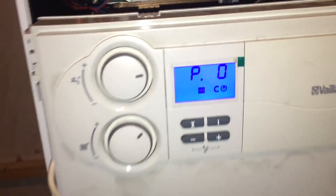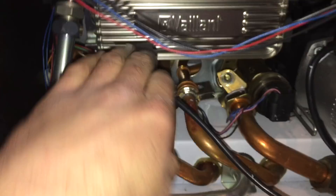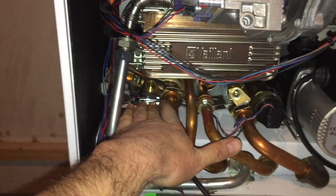What's most common on these boilers — as I'm sure everyone knows — is the water pressure sensor. On this boiler, here it is. It's very common that they get blocked and don't pick up that small increase in pressure. If it's not up there, it's down here. They get — obviously this boiler's just been closed off, but that's where it would be.